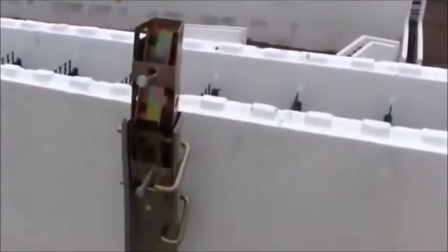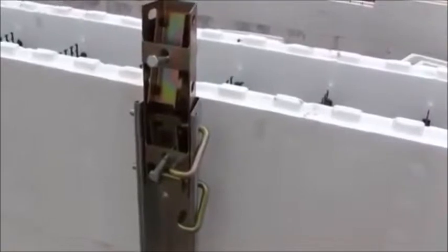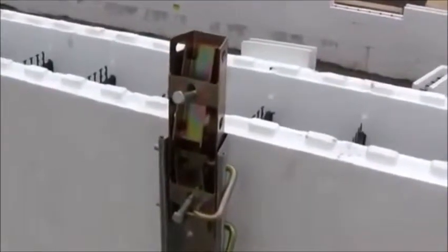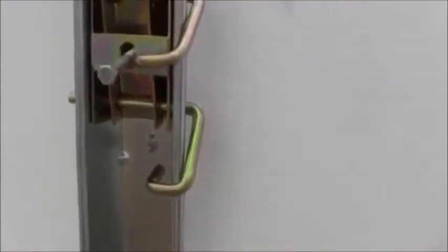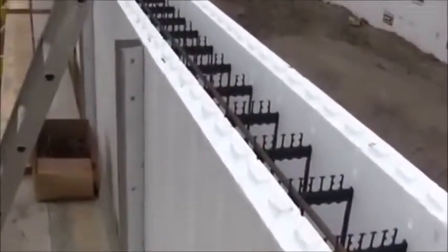With the scaffold, we have this bracket that's clipped on with two gravity pins, and those 3/4-inch bolts get tightened up — it sucks everything together, makes it all aligned so it becomes one pole, and that way we can go up to 20-foot high. Because we're using the hex-headed sheet metal screws, we need to put those in 8 inches down from the top of the wall so this bracket goes in place without any interference. Otherwise the screw head interferes with it, so you just have to think ahead on that one.